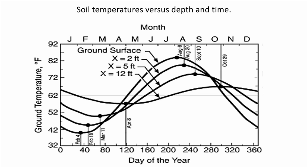The current project's goal is to generate geothermal heat in a greenhouse application, but heat retention at night with some kind of thermal blanket should also be a major focus to help minimize the capital cost of a geothermal system or increase the achievable temperatures. Likewise, the high tunnel design could be better if winter production is planned. Good year-round greenhouse designs are available for cold climates. Combining better placement of ground loops or groundwater use to access ground stored heat, better diurnal capture of excess solar heat in the high tunnel, and increasing heat retention at night should be very attainable, cost-effective, and adequate to reach modest temperature maintenance goals.